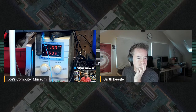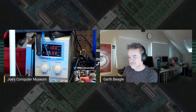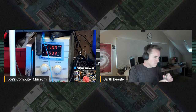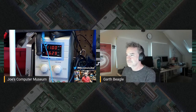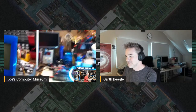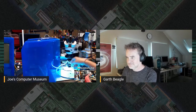Now, the cheatsy doodle way would be for me to look into Pumpkin Tosh and take it apart and figure out which one it was, but I don't remember, so we're just doing it this way. So I think 11 volts is good. Now, we can also try dialing it down a little bit more. So let's take a look at how this looks inside the case to get an idea if it's too bright. Because it's not really there to illuminate the room. The purpose of it is to make the Mac look pretty. So it doesn't have to be hella bright. So we can crank this down by small amounts of voltage until we get a good value.